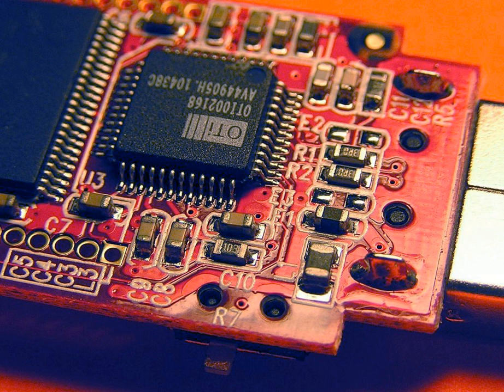Where components are to be placed, the printed circuit board normally has flat, usually tin lead, silver, or gold-plated copper pads without holes, called solder pads. Solder paste, a sticky mixture of flux and tiny solder particles, is first applied to all the solder pads with a stainless steel or nickel stencil using a screen printing process. It can also be applied by a jet printing mechanism, similar to an inkjet printer.